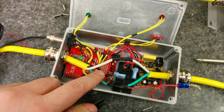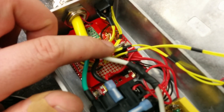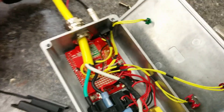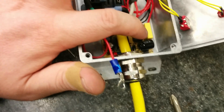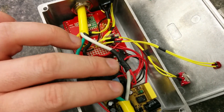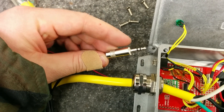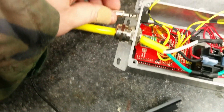I did some wiring over to the prototyping area to connect my various LEDs with current-limiting resistors. Also in there — a little hard to see — is a TIP-120 Darlington transistor, which is responsible for driving power into the relay. The Arduino runs at 5 volts and cannot supply enough current to the relay itself, so I take from a 120-volt to 12-volt DC power supply into the Arduino and also through the Darlington transistor into the relay. Besides the LEDs, there's a front switch and a 3.5mm audio connector for the door sensor jack.